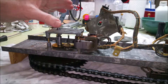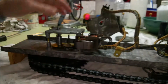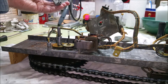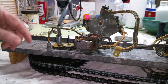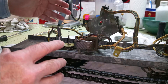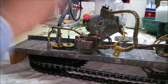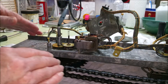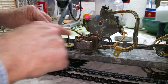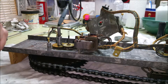With these multi-products motors, when you get down to the motor, you disassemble everything to get yourself down to the motor. The motor is held on by four rivets. You drill the rivets out and then you take the plates apart. This particular motor is hooked up to a double sprocket, double chain timed mechanism for the two cars. I preferred not to have to disassemble that entire thing, so I left the bottom of the motor in place and drilled and tapped the four rivets to accept flathead screws. This is not what you would normally do.